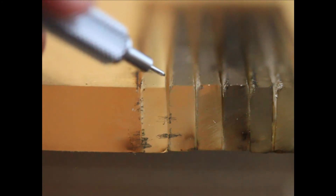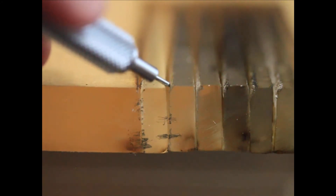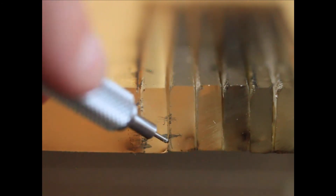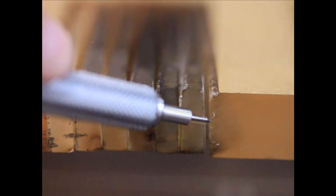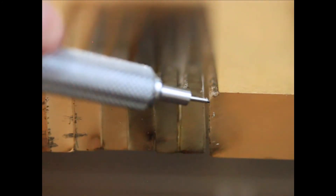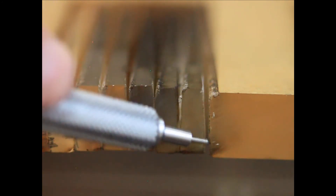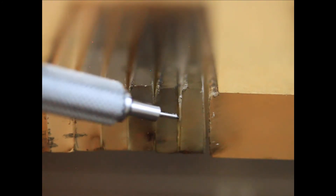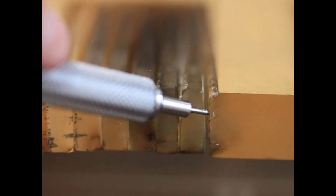I think 7mm per second with the nozzle very close to the surface — at two passes — is actually good. It's clean and doesn't burn the material too much. But looking at the underside, the slower passes are really poor. You can actually see a wide kerf because of so much burning going through at 2mm per second — that is way too slow.